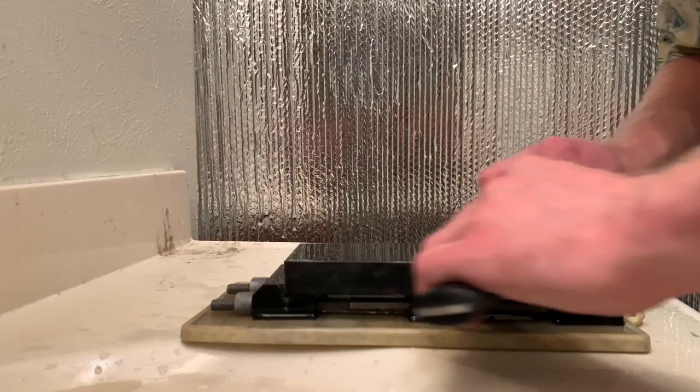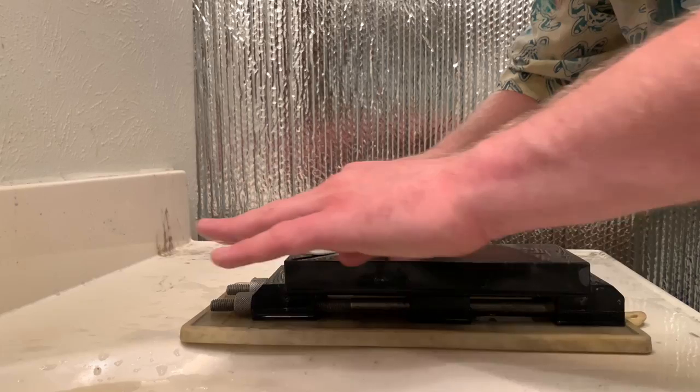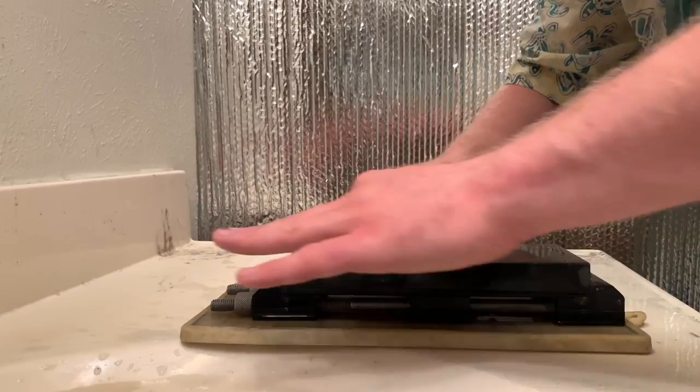And the great thing about the fact that this stone does not gouge is that you don't create ripples or texture changes or low spots when you're really working the stone and pushing with a knife, because the stone is still superior to this hard steel. And even if you try to go point in, you won't actually be able to gouge one of these stones. They're too hard. You'll roll your knife edge very quickly, which can be frustrating if you're a beginner.